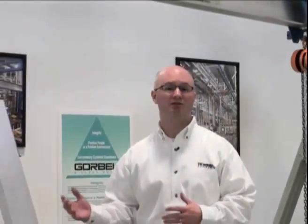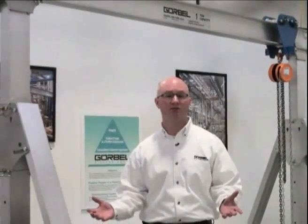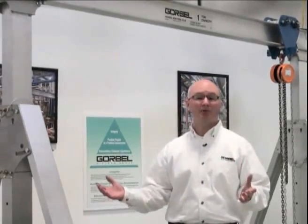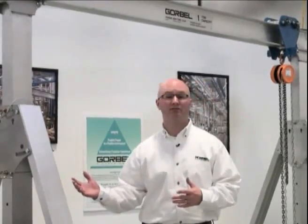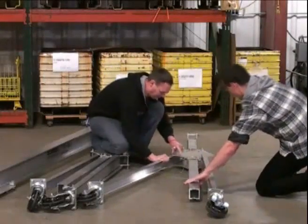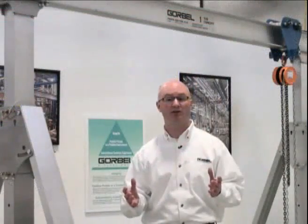The concept for the aluminum gantry crane is very simple. It needs to be able to be moved to a specific location — hence the reason we use aluminum to keep it light. We use channel on our legs instead of full tube, and we use a design that is collapsible. You can actually collapse the legs themselves to fit into small places.